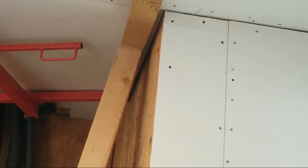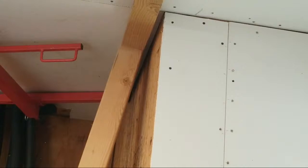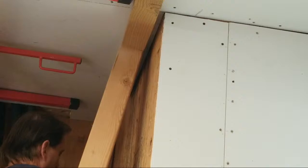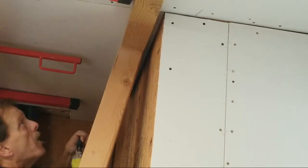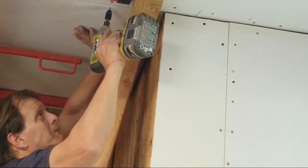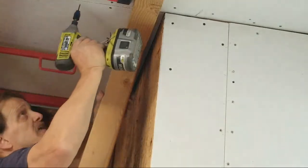But in this room, I needed to make it longer, custom fit it to the room. So remember, you always want it a little longer. Measure from the floor to the ceiling, and then make your drywall tee about 1.5 inches or so longer. That way you can pressure the drywall up, keep it tight to the ceiling. Now, I can get this anchored. You see how it just kind of bumps it right off of there? The clutch kicks in.